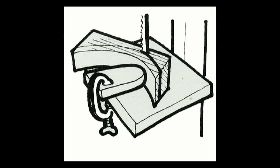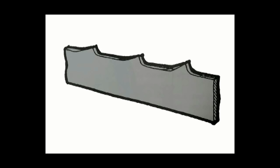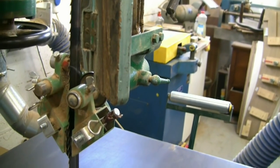In blade jargon, 'skip' refers to the number of teeth on the blade. Generally speaking, a wider spacing of teeth enables the sawdust to clear more quickly, so it's more efficient for deep sawing. The other aspect of the blade is the set, which creates the kerf.